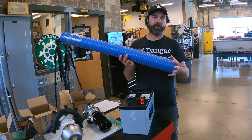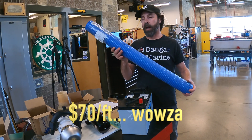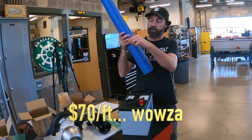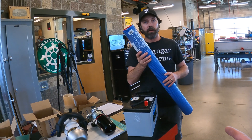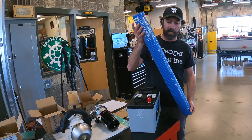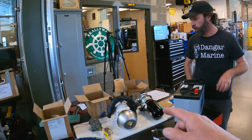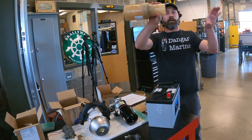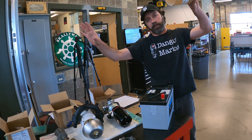We're using high-end exhaust hose. We only needed about a foot but it only comes in three-foot sections at $70 a foot — a bit upsetting — but it's built to last. From the exhaust elbow to the water-lock muffler we'll have this hose, then use three-inch hose up to the riser, and adapt to the existing four-inch that exits the boat.